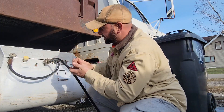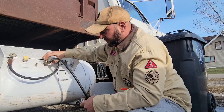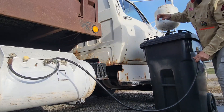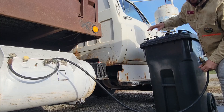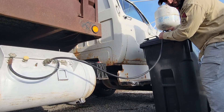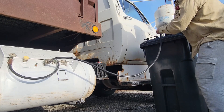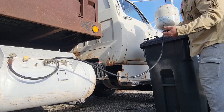Because there's no swivel or banjo fitting on these, I'm not hooking this up to the propane tank until I get it in place. I do have some hooks on the side of this tank, but just for this video I'm going to set it up elevated — it probably doesn't really need to be, but every little bit helps. One thing I haven't seen many people mention is the reason propane tanks have reverse threads — it's so you can't fasten typical pipe threads to them and accidentally feed flammable liquids into an otherwise unsuspecting tank.